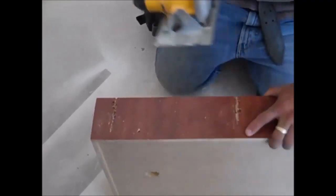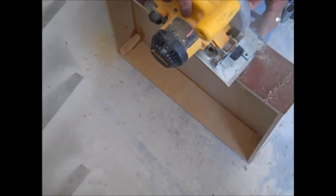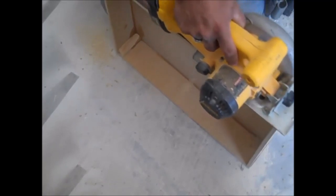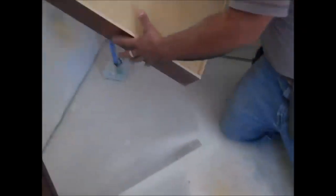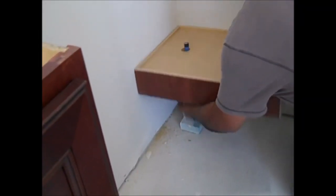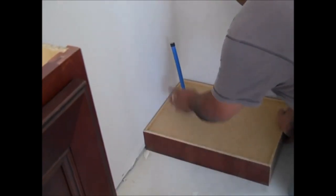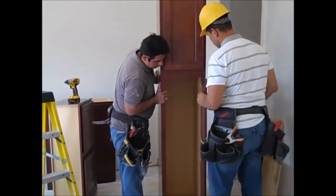In the state of Georgia, the fridge line cannot be on the exterior wall, which is that back wall where the wall cabinets are actually being hung, so that's why it comes off the side. The base of the utility cabinet or pantry cabinet is then cut around the 2x4, and the water line that will go to the refrigerator, a hole is drilled and the base is set.